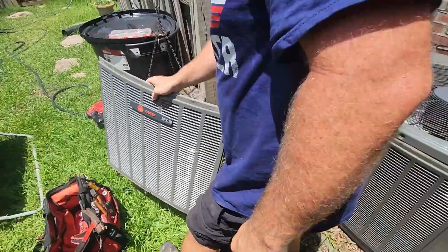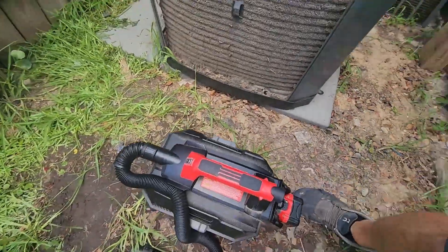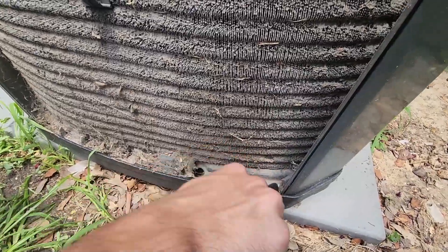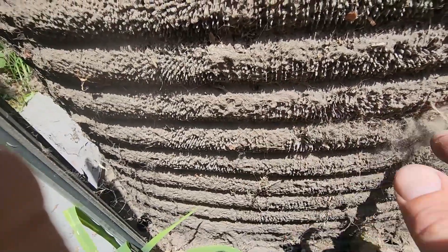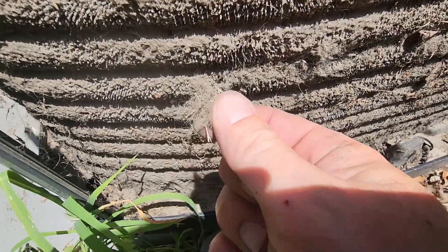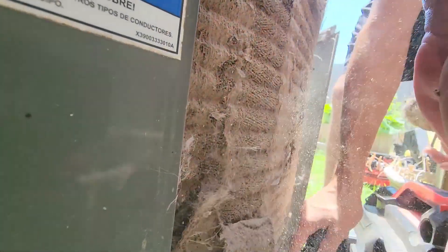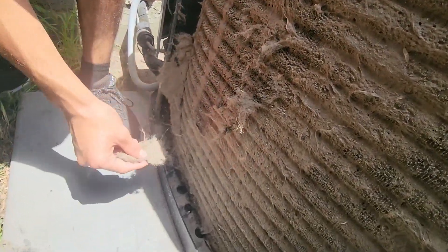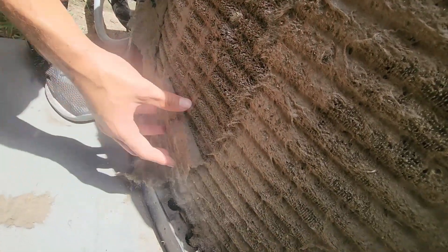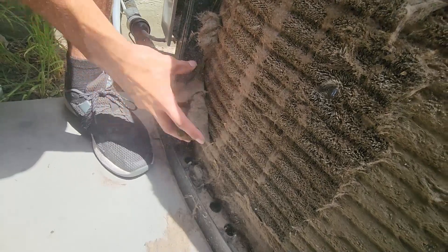Slide up and move these over out of the way. As you can see, it's covered in dust and debris — all this is stopping the AC from getting maximum cool and it is completely gunked up. We recommend having a portable vacuum handy. Watch this — if I just run my finger lightly over these coils here, you can see the amount of dust and debris keeping your AC from getting cool. If you've got caked-on stuff, you may need to use a light brush or peel it off with your hand if it's thick. All this is basically running up your electric bill, making your AC work twice as hard. In summertime, especially here in Louisiana, this is probably costing me an extra hundred to two hundred bucks a month.